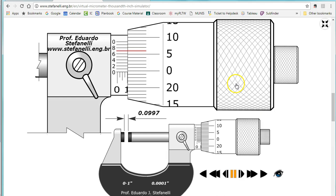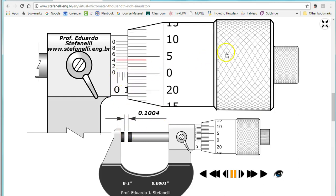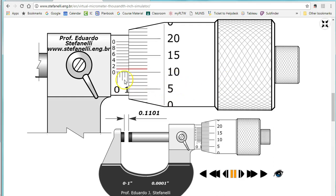Back to zero — one hundred. So twenty-five, fifty, seventy-five, one hundred. Going just a little bit more to some number — it's twenty-five, fifty, seventy-five, one hundred, plus ten gives me a hundred and ten. So I have zero inches, one hundred thousandths, and ten thousandths more.